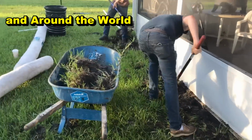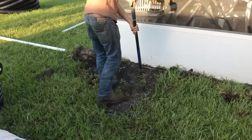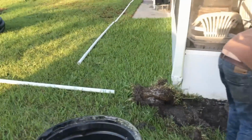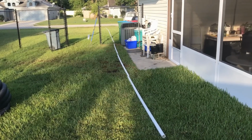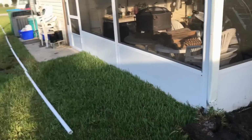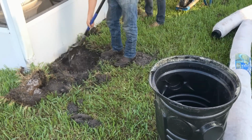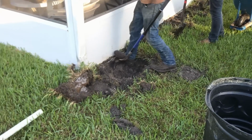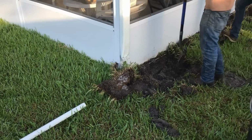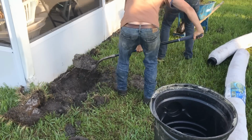And over here on the corner you can see the sump basin. We're going to put a sump pump. That pump's going to lift it up and send it all the way out to the front swale. There's a little gully out there. We're also going to attach the downspout. The pump that we're using is the Zoeller M98, and it'll easily keep up with this flow. So pretty straightforward job. You guys are already starting to dig, and we're going to get this done today.